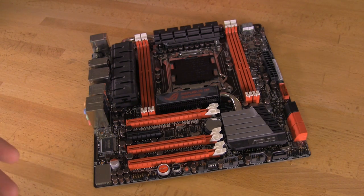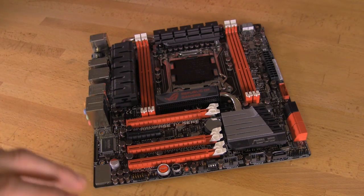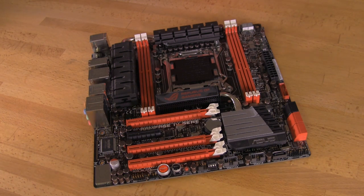You can try and slam as much as you want into a motherboard but eventually you're going to start having traces that crosstalk and you're going to have differences in performance that create issues. One of the things we've always liked about ASUS is that they take extra time to tune the traces on the board before the components go in, so they don't have to fix performance on the back end with a BIOS flash or setting change. You see a lot of that where a board will be released and then you'll have five or six BIOSes coming out in rapid succession to fix one problem or another — or even correct problems created by the last fix, sort of like a Microsoft syndrome.